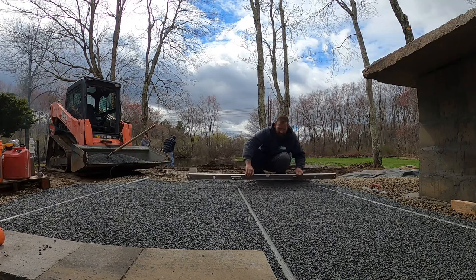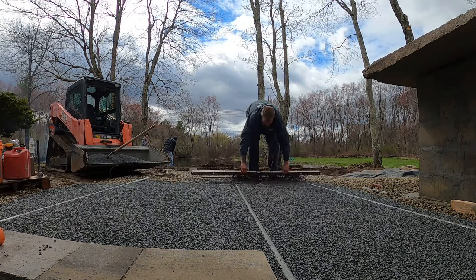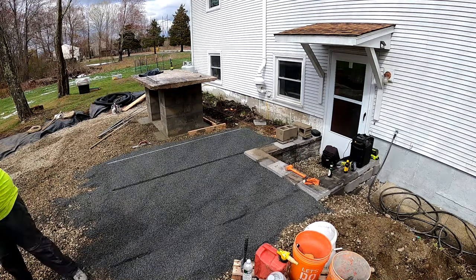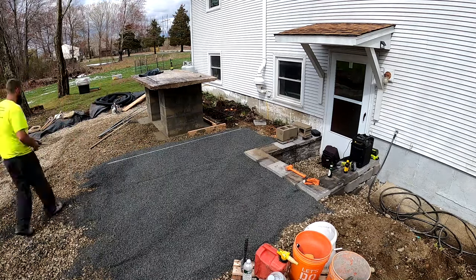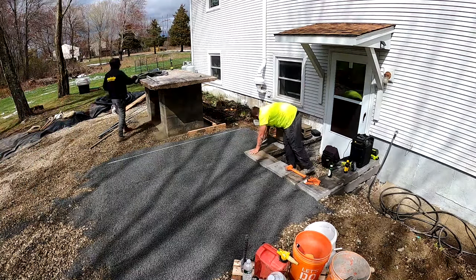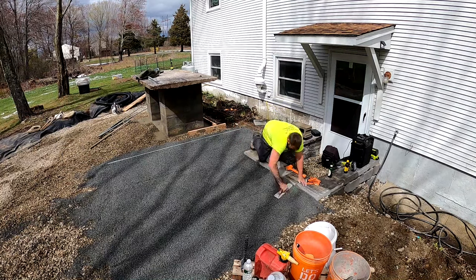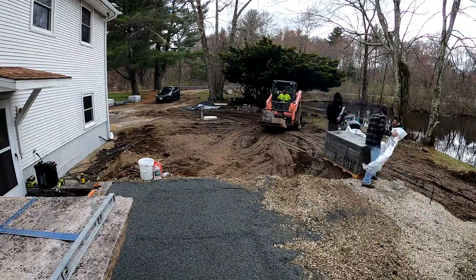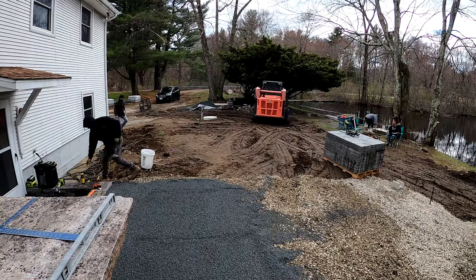And for anybody that's in the industry, like I've explained myself in a lot of videos on my channel, we use open grade base and this 1/4-inch crushed chip stone to allow for water to freely flow down into our sub base and prevent any water buildup under our pavers, because that is the worst thing for any kind of paver or natural stone install, is for it to be sitting in water.